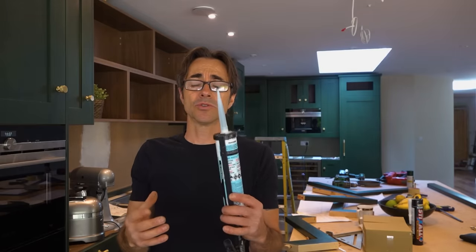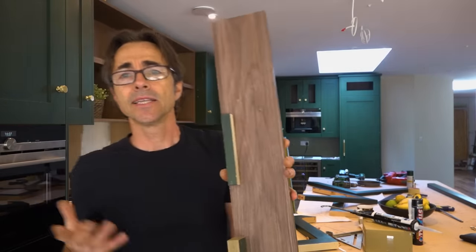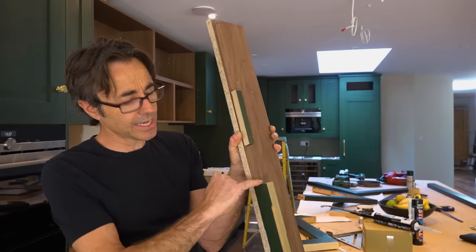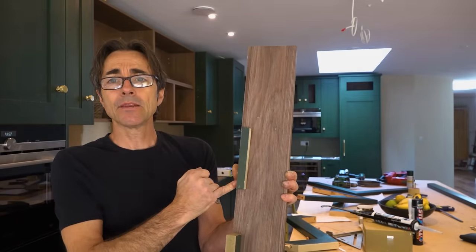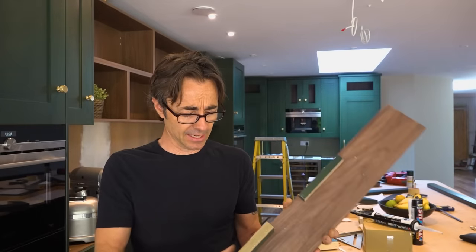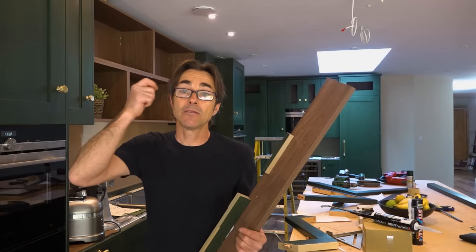What I like to do is test this kind of material. Here I've got a section of the Lincoln Walnut and some painted MDF - a section joined on the edge and a section joined on the painted side. All I've done is put a bead of the adhesive, pushed it in with no clamping, and left that since this morning. It's an adhesive which takes quite a while to cure but it grabs and holds, and goes off really nicely. This one's actually been on a few days and there's no way that's coming off.